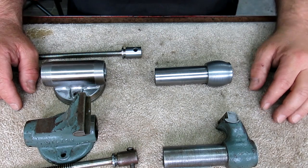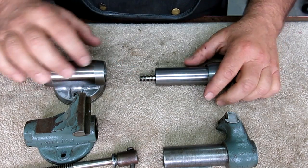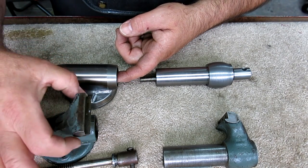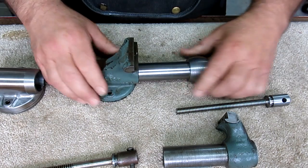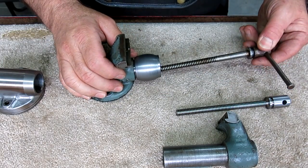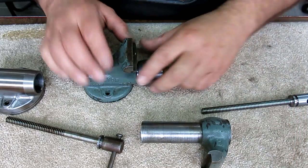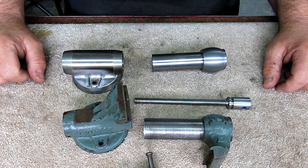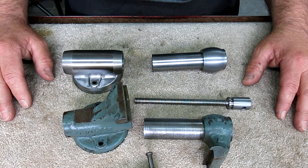This part will be done until we make the jaw piece. This bore is still distorted from welding, so we're going to wait to size it after we weld the jaw — there's a bunch of welding there that's going to tweak that bore some more. But that's the idea, and it's pretty good actually. Pretty soon we're going to be doing these jaws, which will be pretty interesting. Thanks for watching guys, thanks for following the project and for all your great comments — this is turning into a real fun little project.